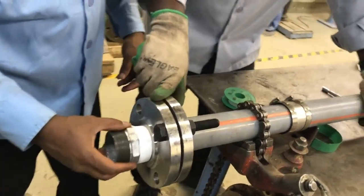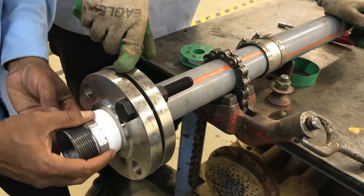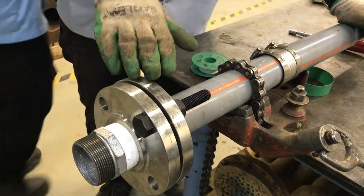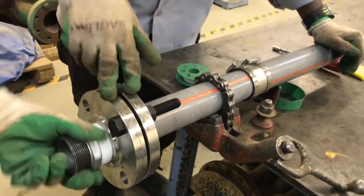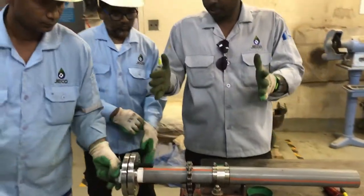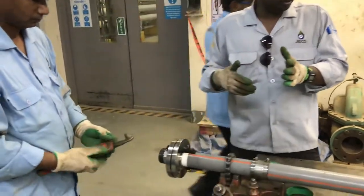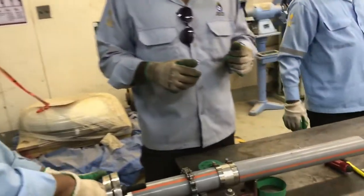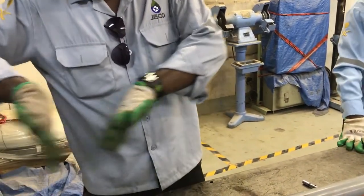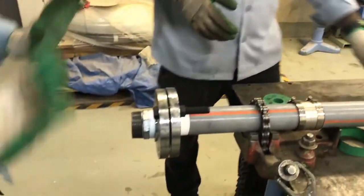Normally a flange joint is recommended for easy dismantling. Most likely the pipe joining the pump section and pump discharge will come with flanges. Then at a valve also, normally you can see two flanges will come, and inside will be the valve. So during valve replacement, we can just remove these nuts and bolts, take the old valve outside, then install the new one.